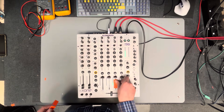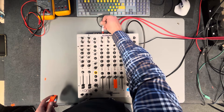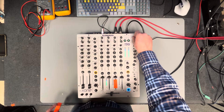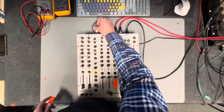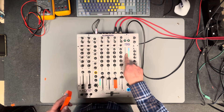I've just finished checking the line inputs and now we're getting closer to the issue. It's not the second and fourth phono channels causing the problem, but rather the first and third channels — each has a defective side. To keep track of these, I'm marking the faulty channels with some colorful tape so I don't lose sight of them during the repair process.